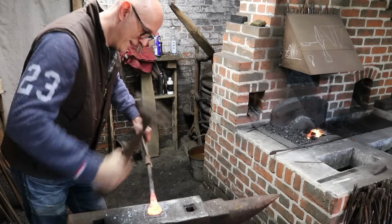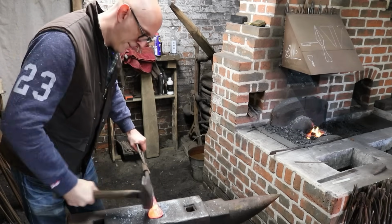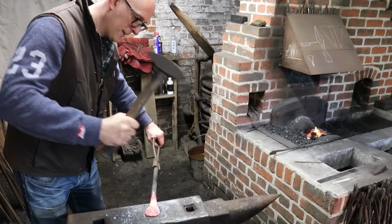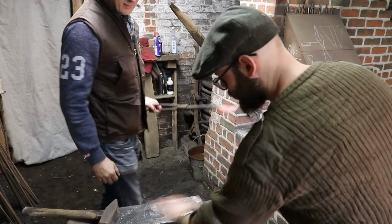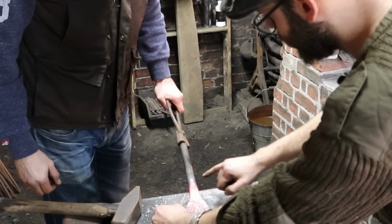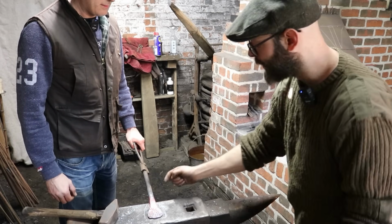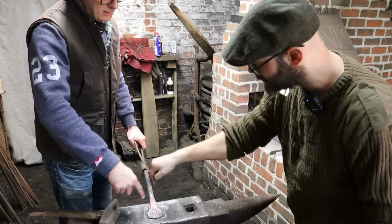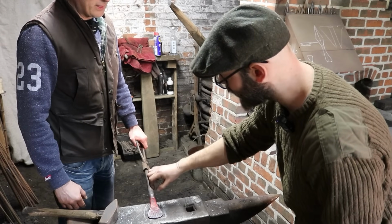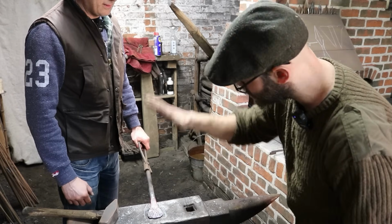Is this all right? Yeah, it's perfect. Don't make it too thin. Good. Compare it to our 3-inch template. So that will all come out once you start working this middle bit. You've now got to focus on here, because that won't roll and wrap. So you want to spread this by keeping it exactly where it is, and it needs to be bowed outwards. That will happen because it's already tapered. As you flatten it, everything will spread out. Where it's narrower, it will spread less. You want to keep it here and just work flat.